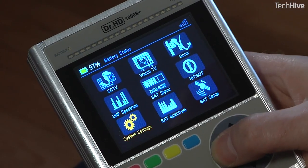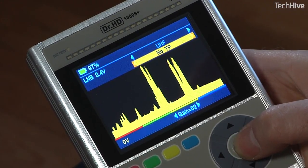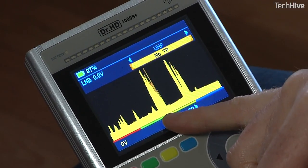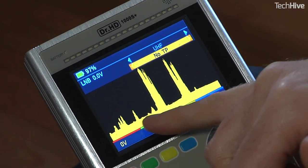This should help that — I'm going to show you what it does. I have my meter here switched on the UHF spectrum, and this is showing me from 450 megahertz up to 1050. In the United States, television goes up to 700 megahertz, which is about halfway, so all of these peaks down here are TV signals.